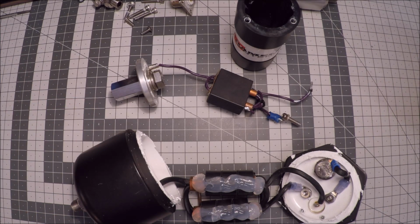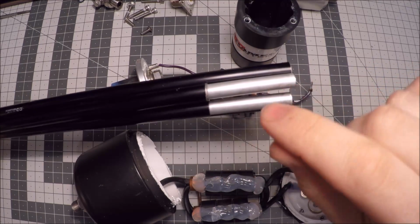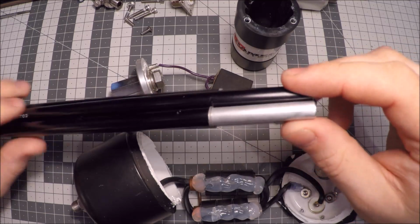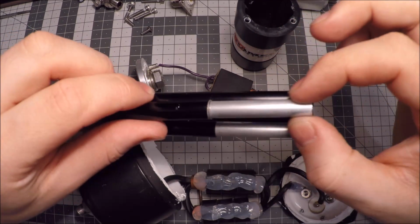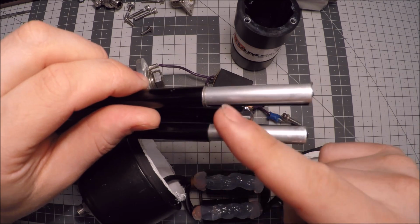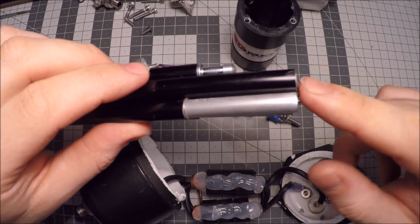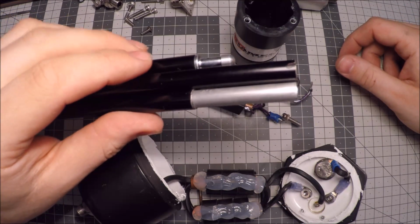Also, one more big difference is the connection points. And this is the military whip, as they call it. The elements are much longer, the whole whip, so it's stiffer. Other people on the internet have done some tests, and this whole aluminium part is conductive, so you get a lot of contact area. But on the EC Military whip, only this shoulder on the edge here is connecting. In the beginning, when everything is new, that would be okay, but when this bungee cord that's keeping these together gets worn, you would lose connection here over time, and it would be bad for your transmission.